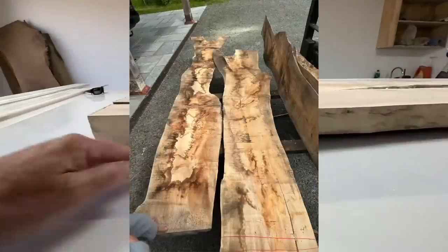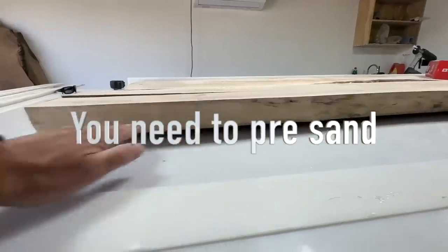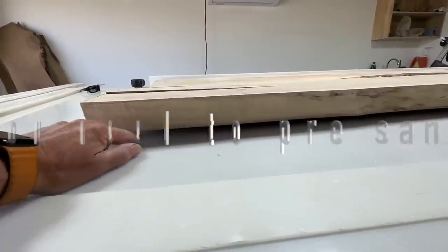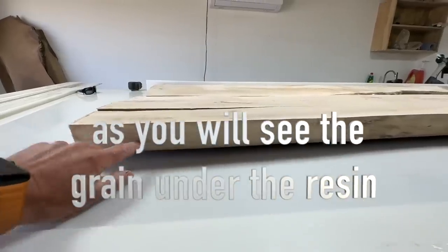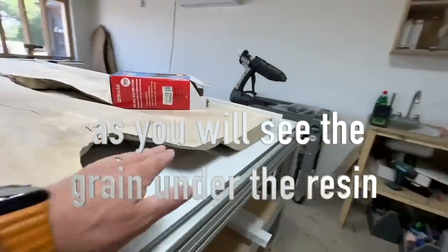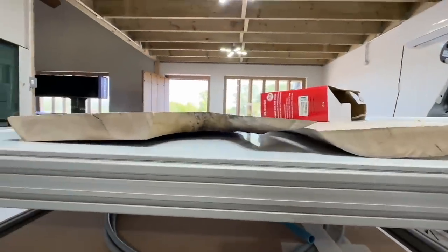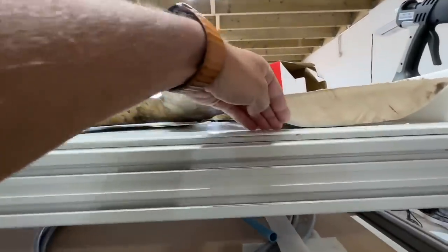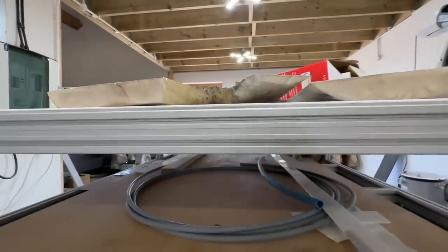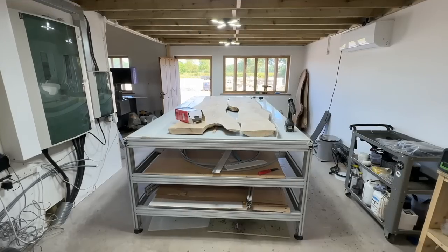So when we do this resin pour, we're going to have resin. We're going to grind this off once it gets flat, so it's going to get quite thin in places. It'll be some resin, some wood, natural wood. There's all different heights. I'm actually balancing this on here to split the difference. You can see here, we're going to have a lovely big section of resin here, no wood at all. Quite a lot of resin underneath, but that will be ground off.